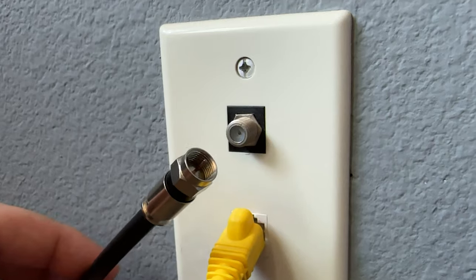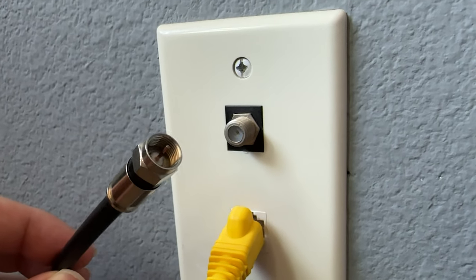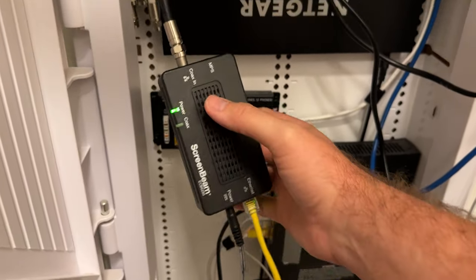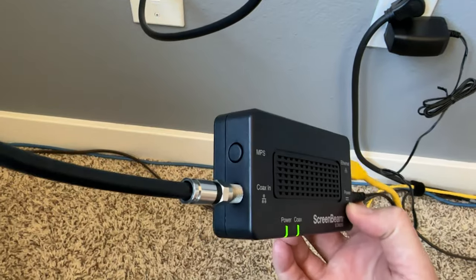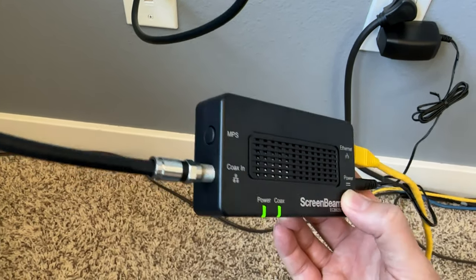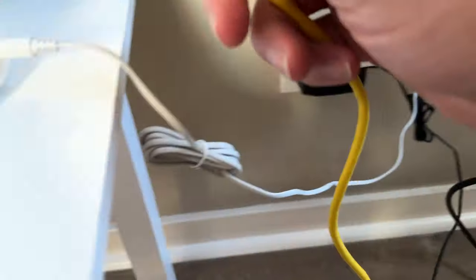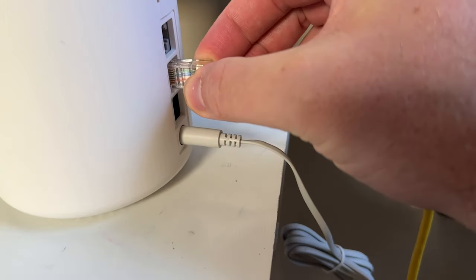There's a good chance that you don't have ethernet ports around your house, so WiFi is just the simpler and easier way to go. But there's a really good chance that you probably have coax cable in each room - this is the cable you use to get cable TV service into your house. Did you know that you can actually transfer data over those cables? You can buy a pair of MoCA devices like this one. You put one on your modem side where your switch is, and the other in that bedroom. You can then connect ethernet cables into it, giving you an ethernet connection in that room where you can plug your mesh satellite in to get a better, stronger signal.